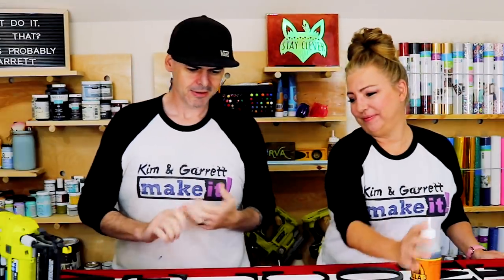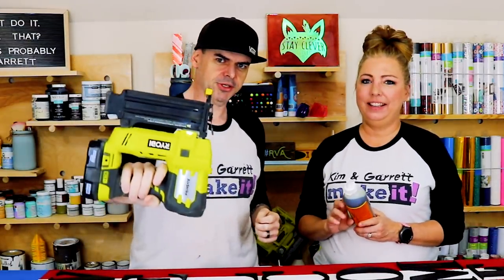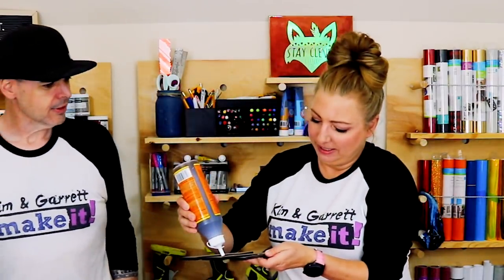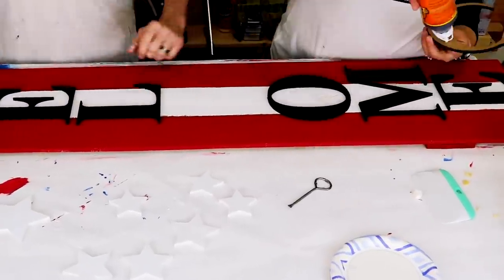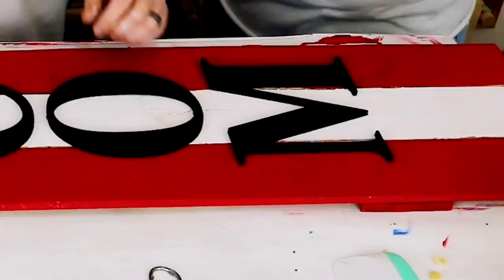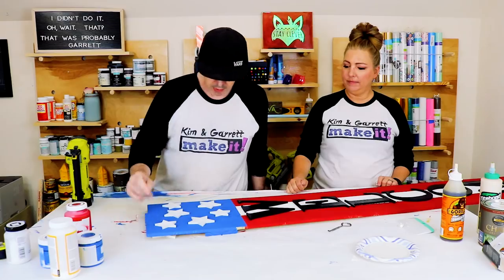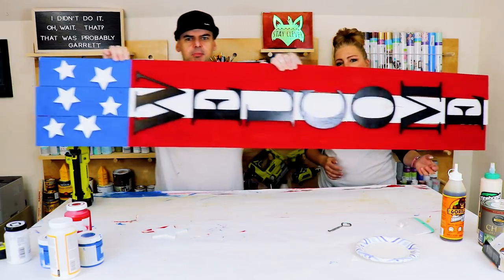Right? Okay. All right, so now we're gonna glue them down and then pin them with a 5/8 inch brad. The nail, not the guy. Looking good. All right, sign number two.